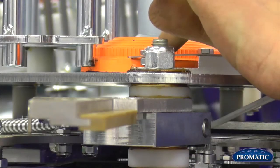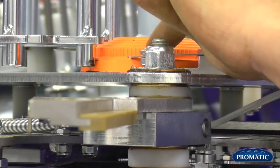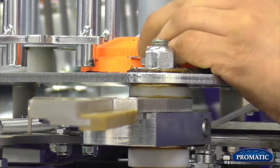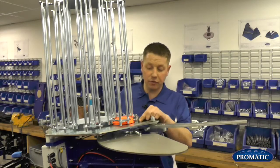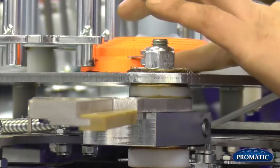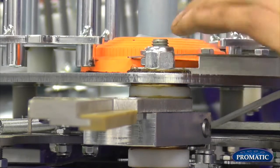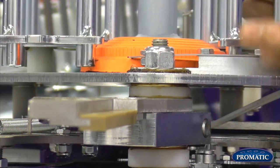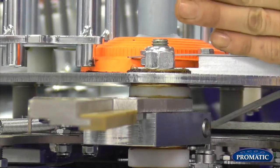So we're looking for a couple of millimetres from the inside of the blade or the outside of the blade at the one at the back. And in regards to the thickness, we're talking about the thickness of your thumbnail. You have a nut there which you can raise up or down. It's the same at the back. All the knife edges are slotted, so you can move them in or you can move them out accordingly.